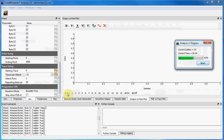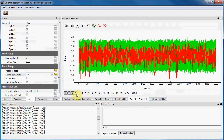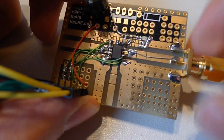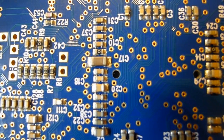What we can do after running the attack is plot results over time to determine where sensitive operations are leaking. Here I can see successive bytes leak as I move forward in time, suggesting a simple loop. My hope is ChipWhisperer becomes part of dismantling the secure-because-math mindset of many embedded engineers, so we can truly begin to understand the security of the systems we are designing.